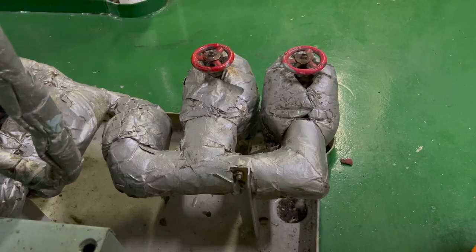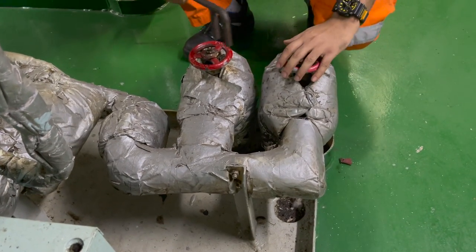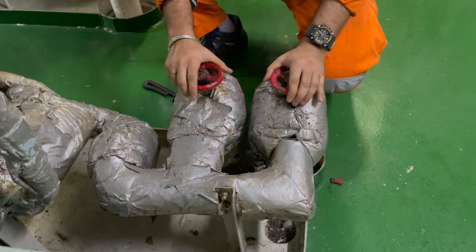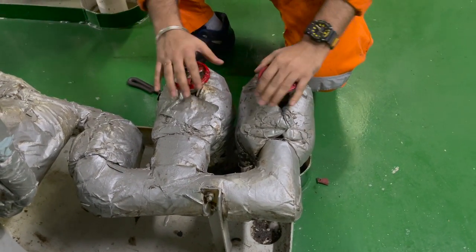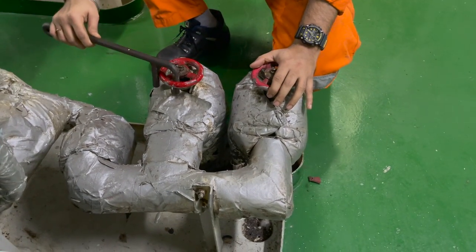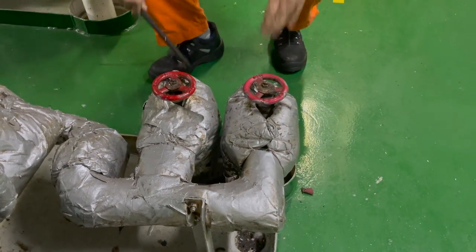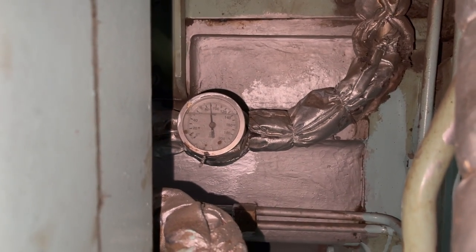Once the RPM is achieved, I check the temperature — it is somewhere around 130 degrees Celsius because it is on HSFO right now. The first valve marked with an 'F' key is for MGO and the right-side valve is the LSMGO valve. I will slowly start opening the LSMGO valve and simultaneously start closing the HSFO valve, so LSMGO will start coming in through the main line and HFO will stop.